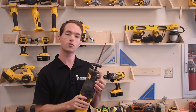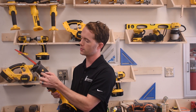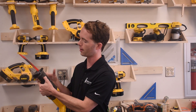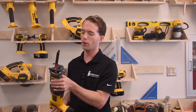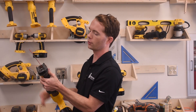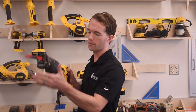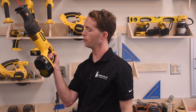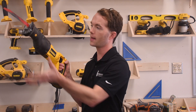The plate on the front of the saw can also be varied just a little bit — you've got about an inch of travel. To change the position, you push this little yellow circle button on the left side of the saw and pull it out to one of its positive stops. For the most part, with the wise choice in blade length, you just leave this all the way back. Like every other saw, keep this plate flat on your workpiece as you use it. One hand on the trigger with the variable speed trigger lock right above it, second hand goes right in here — get a nice firm grip, secure your workpiece, and have at it.